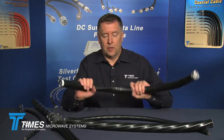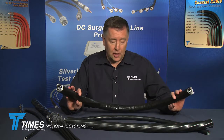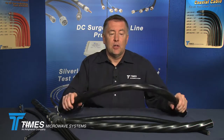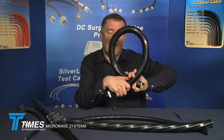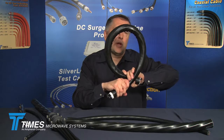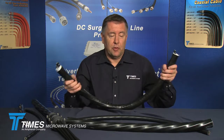This here is something we did for a COLT, a cell site on light truck. It's actually a flexible bundle cable, very flexible bundle cable. We took our LMR 400 Ultraflex cables, bundled them together, and put a rubber jacket on the outside. So you look at the size of this, and you can see what you can do with this cable. These are 9 conductors, 9 3/8 cables inside this bundle. So this is something where the tower would come down, and the cable would be coiled into a box. Very, very flexible. Lots of things we can do with bundled cable.